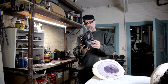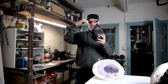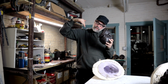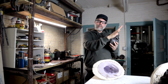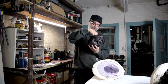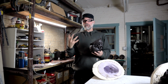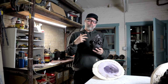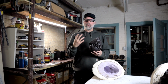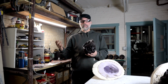In this case, what we're going to do is tilt the mold up and pour, so we can introduce the wax so it slides down the back of the skull, and as it hits that back wall, it'll easily fill up that chamber. If we went perpendicular and just splashed it in, we're going to hear a lot of gurgling, a lot of noise, a lot of turbulence that ultimately mixes air with the wax in the mold, which will generate distortion, porosity, and other casting issues that we'll have to fix later on down the line with the chasing.